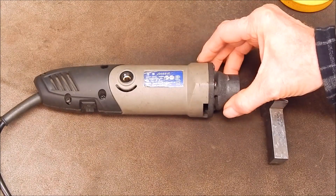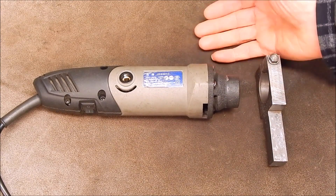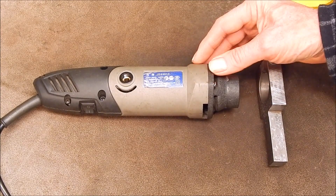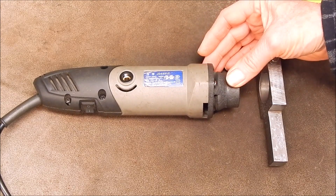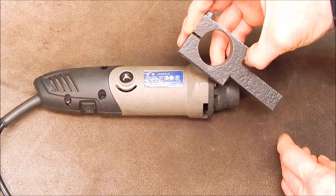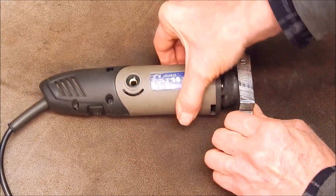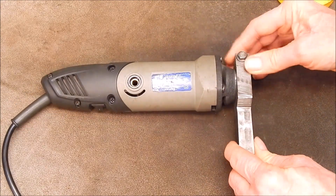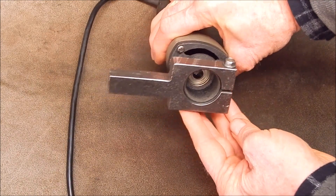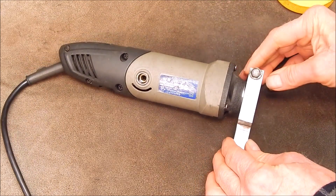These are an indispensable tool in the workshop — super handy, cheap to run, you don't need an air compressor, they're pretty quiet. They're a good unit. As well as grinding and drilling, I've also used it as a tool post grinder. A lot of other people have too. You simply make up a bracket that goes in your tool post, this fits on, and you snug it up with a pinch bolt. That's all there is to it — works great.